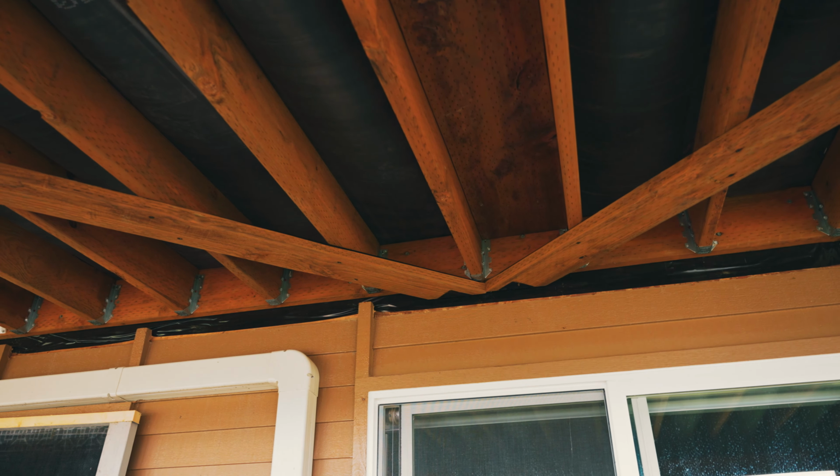What else? Oh, we did our V-bracing. So V-bracing, what it does, and we have a video about V-bracing out on our channel, so go check that out. But V-bracing is one way to make the deck rock solid to keep it from swaying back and forth. Just when you're walking on it, if you don't have V-bracing on your deck and it's a long span like this one, 62 feet, it can roll back and forth pretty easily. So we try not to do that by adding the V-bracing. You have to use 2x4 construction legs. I'm using a FastenMaster TimberLOK to lock those all together. And that really keeps this deck from moving around.